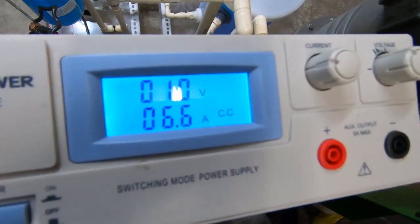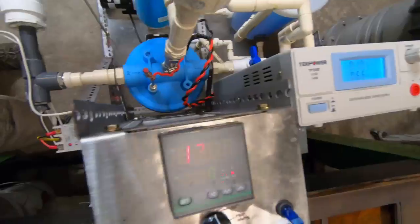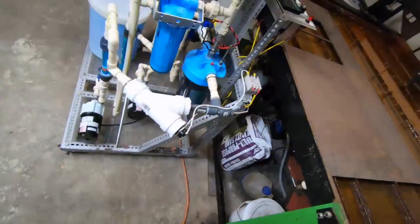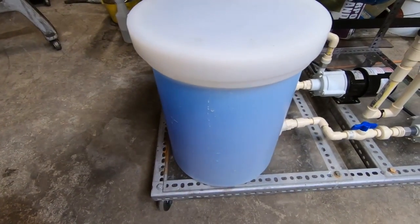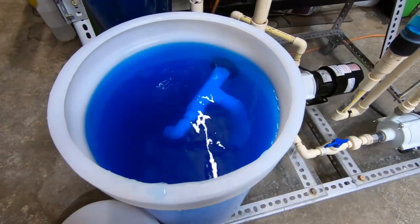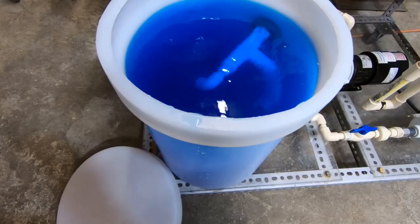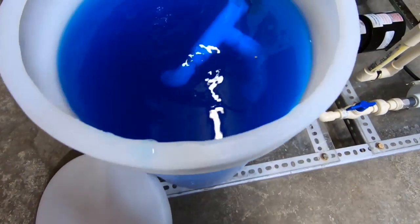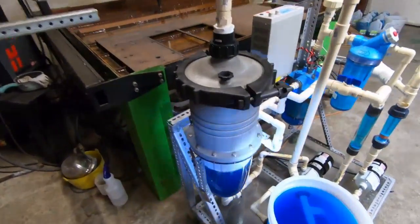The system is running. We are running at a very low voltage this time, which I like to see — never been able to run it at a voltage that low. We're at 6.6 amps, 120 degrees Fahrenheit. I've lowered the temp this time around to see if we can save that anode a little bit. This is the main reservoir — large amount of electrolyte in here. You can see the turbulence has reduced drastically, and I'm hoping that any anode sludge that develops will pool up in the center of this vortex. We also have the main cyclone, which is in fact producing anode sludge down there, as you can see.